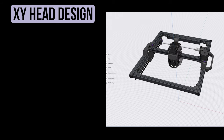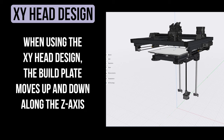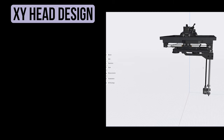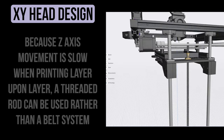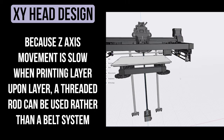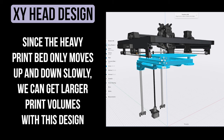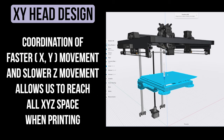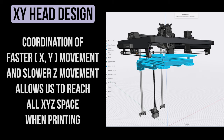So the printhead moves freely at the top of the cage along the x and y axes. But what about the z-axis movement with this design? The build plate actually starts up at the top of the cage near the printhead and moves downward throughout the print along the z-axis as printed layers are constructed. Another stepper motor attached to a rotating threaded rod moves the build plate up and down as needed. This type of design means you can get a larger print bed and print volume because we are not required to move a large heavy print bed rapidly within the y-plane — we're just going to move it slowly downward along the z-axis. This is my preferred approach for both of my 3D printers.